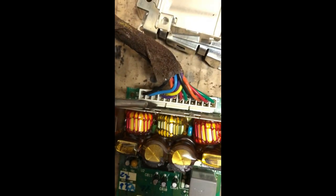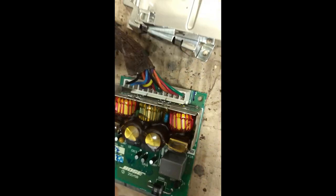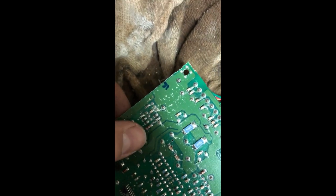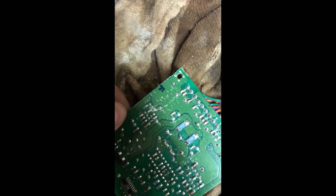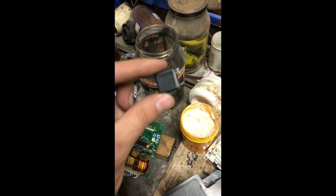To get to the amp we undo these four screws, but getting the cover off is proving extremely difficult. You have to bend these tabs back — there are three of them individually — far enough to get past the tabs but still press against the middle piece. I'm going to see if I can do it without taking that out. The component that causes the issues is apparently this relay over here. Underneath it there are five soldering points — we'll loosen those, take this part out, and re-solder it in.